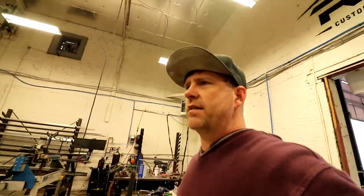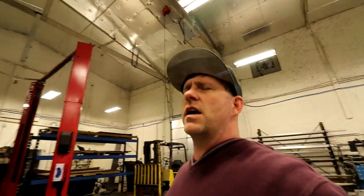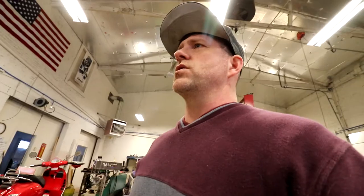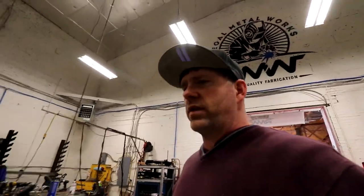Hopefully you enjoyed that. And like I said, if anybody has any feedback on the machining, I would love to hear it. The other thing, I don't know if I'm getting some tool deflection maybe that's putting those lines in there. The tool's kicking out and it's not hitting the original lines in there. Not sure, but I'll have to go back to the drawing board on that one. But the part's completely usable, so that's what prototyping's for.